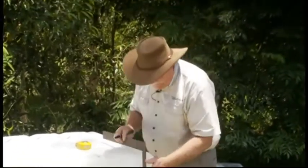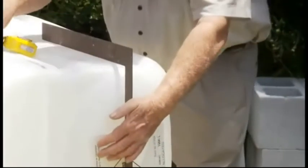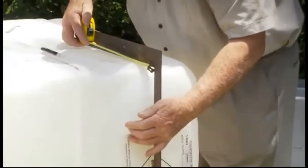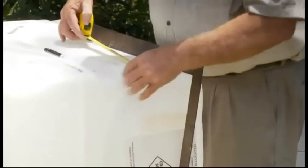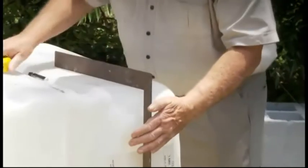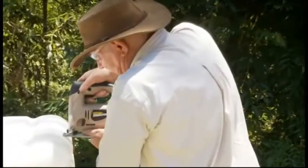This is why we have our big square — so we can push it along the bottom. We're going to determine where our bottom point actually is. We're going to measure from the inside of the square. Otherwise, how do you know where to start measuring from? Here, or here, or here? Because you've got quite a rounded edge. So that's the technique we use to determine where the end is. We just need to line up our mark and make the entry.